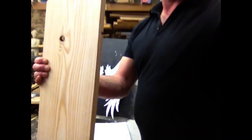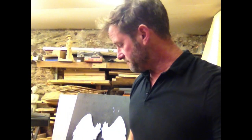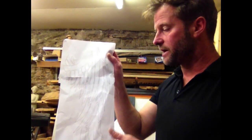I'm going to make this out of a regular piece of pine. Then I'm going to get an image, transfer it onto it, and then carve it out. I went online and found some good wing images — this is the one I selected. I've just printed it out and I'm going to use the laser printer cellulose thinner transfer method, which you'll see in a sec.